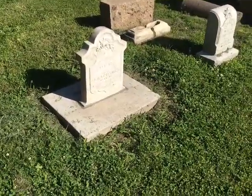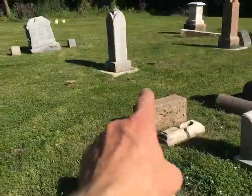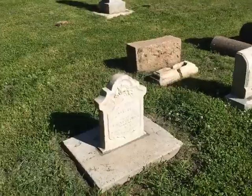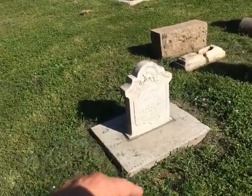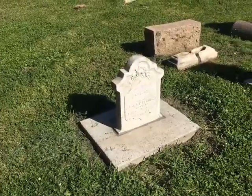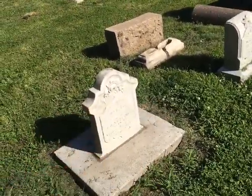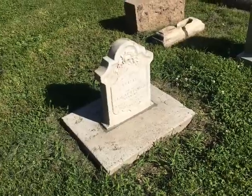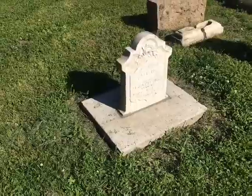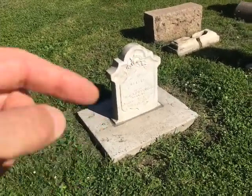So back to this one — it's kind of a new design or theory. We're still going with kind of a floating apron, like I've done on these stacked monuments. Basically it's about 30 inches by 24 inches, formed using two-by-six materials. And then in the center I also put a foam core or form so that it would leave a cavity that created a through slot.